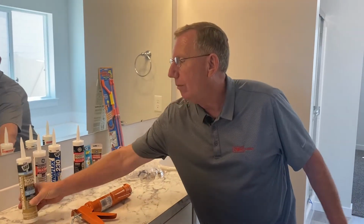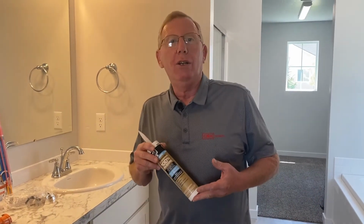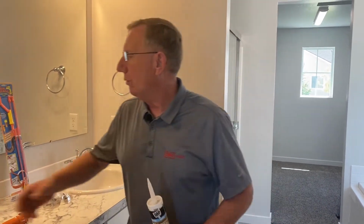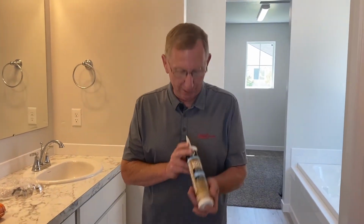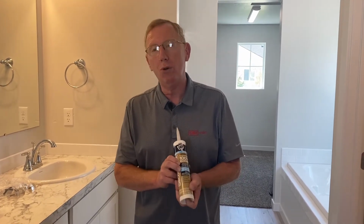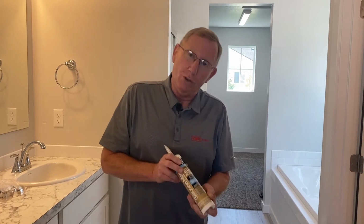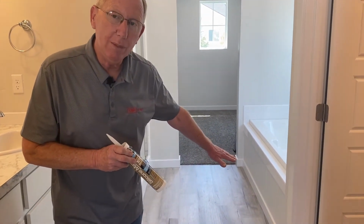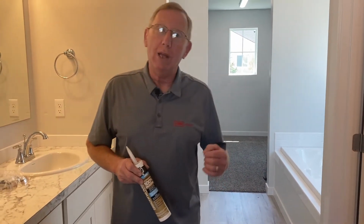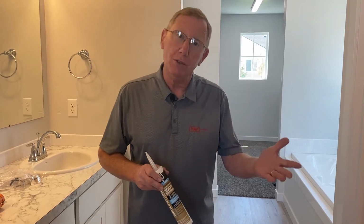So with that being said, what do we do? Well, let's say I want to use the DAP product. I am not here to tell you that this is superior to this product or anyone else down the line. That's not my place. All I'm saying is you want to use a very good silicone caulk to apply to this floor and that baseboard. So we're doing it right in between to take care of the issue of water weeping in underneath the tubs as well as the shower.